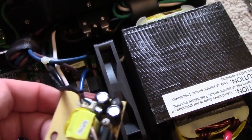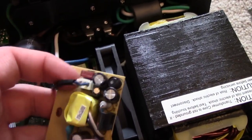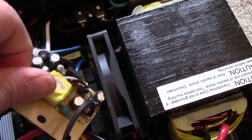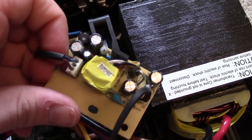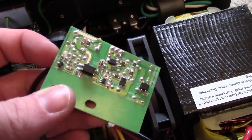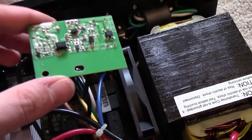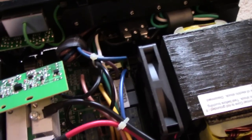You could just use this out as a regular power supply. And that also means that if you don't want this sort of consuming quiescent current, on a REV2 all you have to do is just unplug the mains connector right here from this board, and that completely disconnects it from power. With REV1, you can't do that because it's built into the board — there's really no easy way to cut the power. But on REV2 you could easily disable this if you wanted to reduce the idle power consumption of your unit.